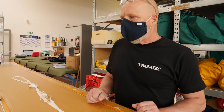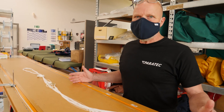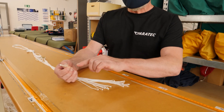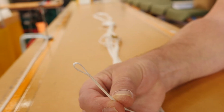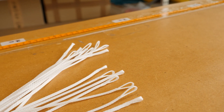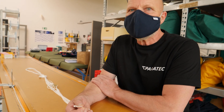This is the part of the production where the lines are being made. The lines are cut to appropriate lengths, and then we use what's called Chinese finger trapping — loops are created which attach the parachute to the line, and on the other end the line to the risers, as we've seen in the packing.